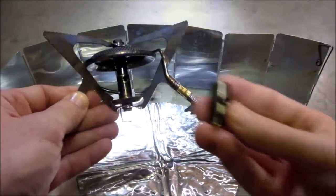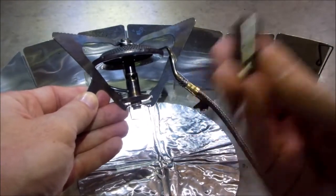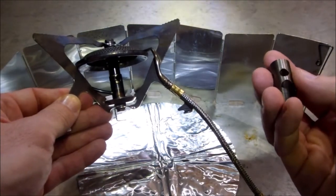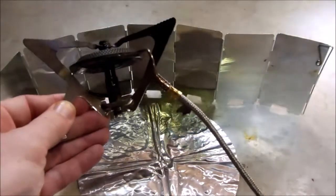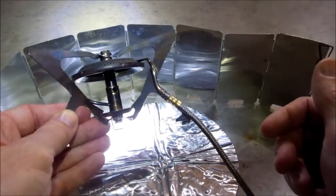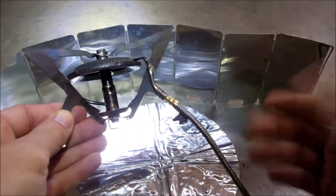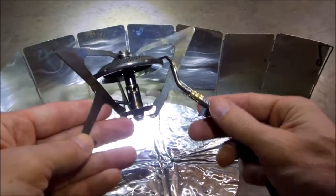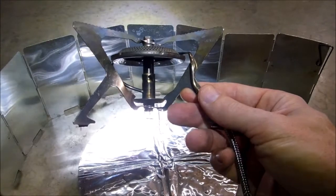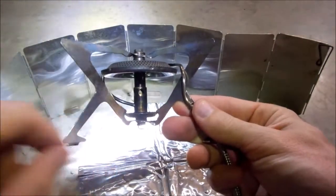The problem with the dampener system is that it literally chokes your stove — it reduces your overall BTU output. So though you get the stove to run properly on alcohol, you've negated that by increasing your burn time. In my opinion, that's a negative — it doesn't really help you. The only effective solution is altering the jet.